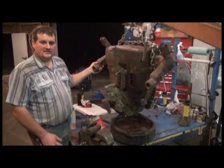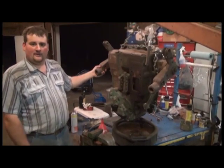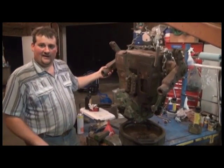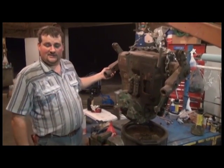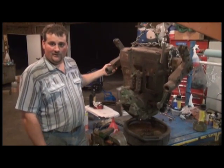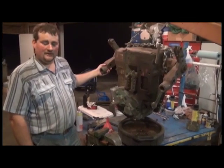With the John Deere system, and particularly focusing on the 630, although the other models are very similar, power goes to the power shaft, and it's live, meaning independent of the transmission. Whether the hand clutch is engaged or disengaged has nothing to do with the power shaft, which is quite handy when you're doing anything in the field such as baling hay or using a rotary mower.